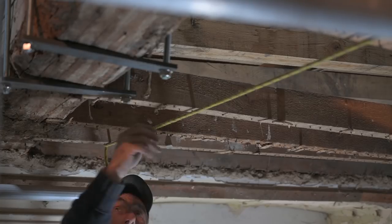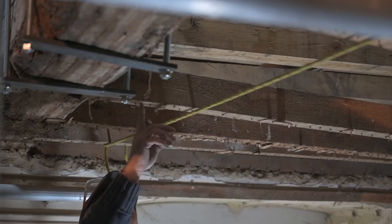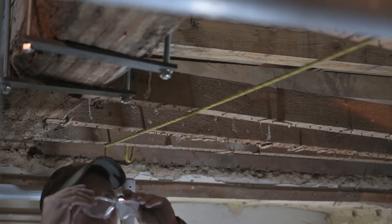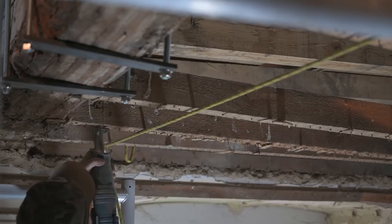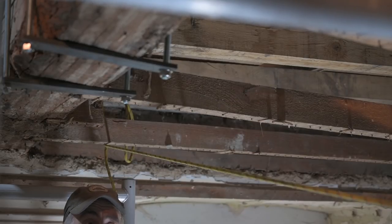Now they are nailed in with some big nails. So I want to make sure that I don't cut in the nails. I'm going to cut a bit away from them. And then I'm going to try to split these blocks because I don't want to damage the old oak beam. I think this is about right. So that was number one.